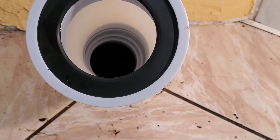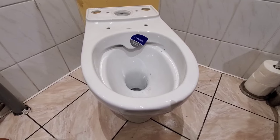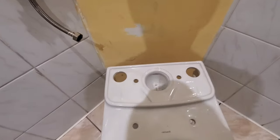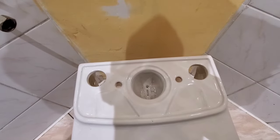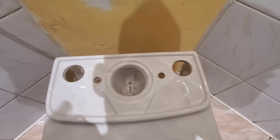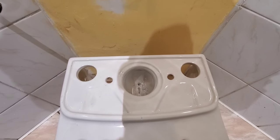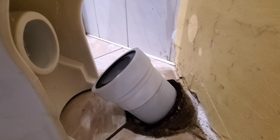Because this is flexible, I'll figure out what to do with that at the end. I'm going to silicone all the way around it just as an extra precaution. So this is the bowl. The screw on the left is not going to be covered. We need to make sure the bowl is straightened — it's crooked towards the wall. We also want to make sure the outlet tube is going to be a short run. We definitely don't want a sagging section, because if the toilet is far from the wall and you have to expand the tube, a sagging section is eventually going to get plugged up with solids over time.